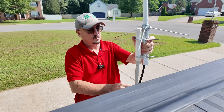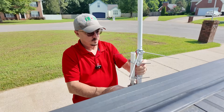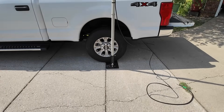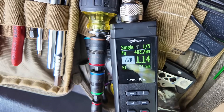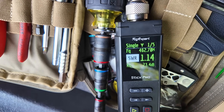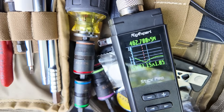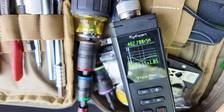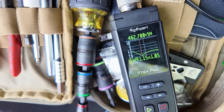While we're talking about the antenna, I did take an opportunity and put that thing on a temporary mast. I wanted to get it up and take a look at the SWR readings on the antenna. And I've got to say, the sweeps of that antenna looked fantastic. I think that is definitely going to do the trick when it comes to putting this repeater onto the property.